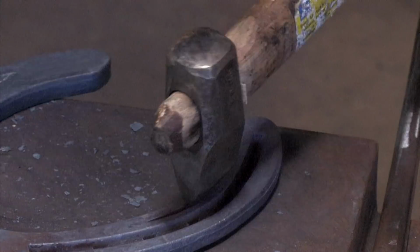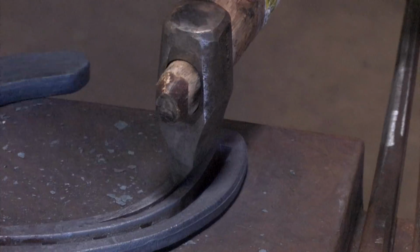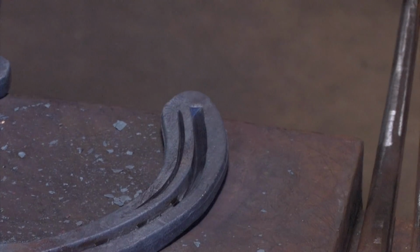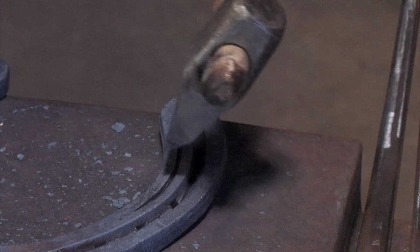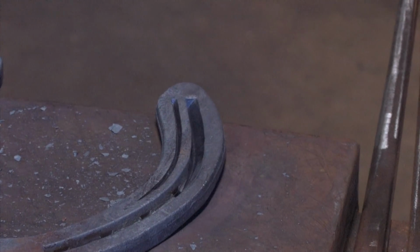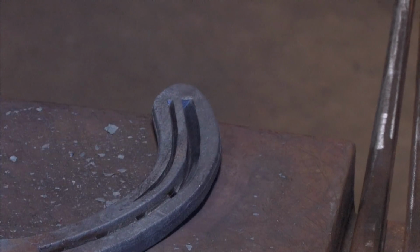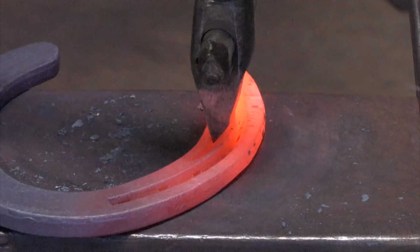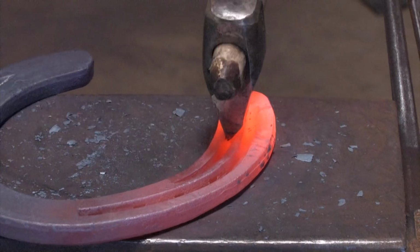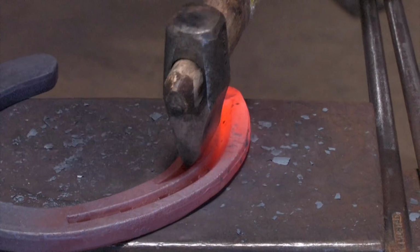I've gone up to the quarters, fullering right up the middle between the fullering and the edge of the shoe. My stops are pretty close to the end of the heel check. We can bring this double fullering up as far forward as we need. Continue overlapping our fullering, don't move it too far, otherwise it'll leave chops in the bottom of your fullering. The more you overlap, the smoother the fullering will be.